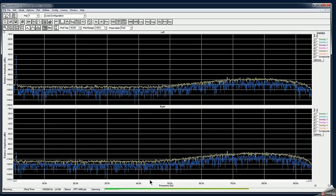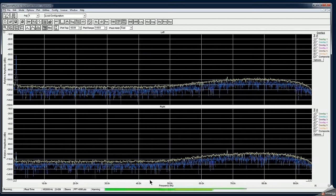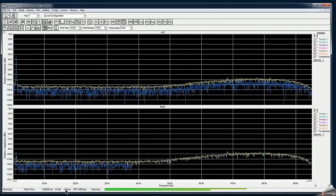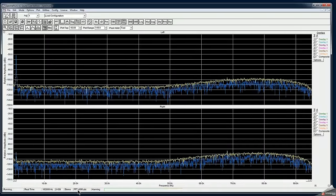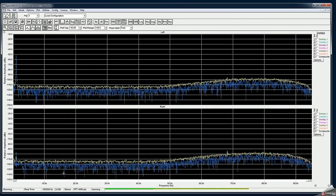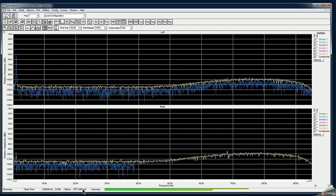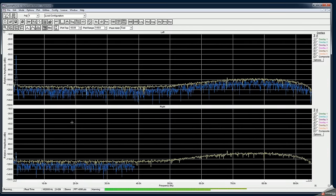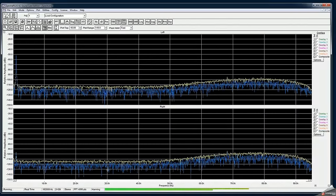So I have this software running, capturing the incoming signal using the Windows drivers provided, and this one is using a 192 kilohertz sampling rate at 24 bits, and this is a stereo signal, as I said. This is the Fourier transform frequency plot, where the window size is 4 kilo points. So basically what we're looking at is a CV signal, so the sampling rate is not as important, so this one is pretty quick. And this is the Hanning window.